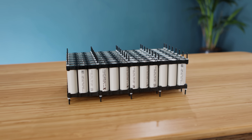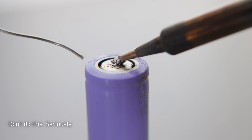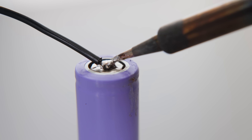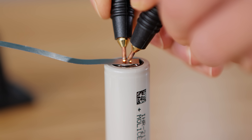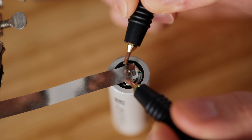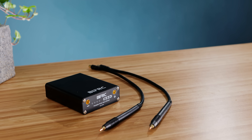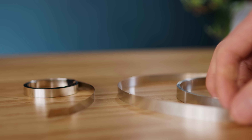Before that though, the next job is to wire up the cells. Now if you've seen other videos on YouTube you might have gotten the impression that it's fine to just solder wires directly onto them, but this is actually a very bad idea — it can not only result in dry solder joints due to the mass of metal that has to be contended with, but it inevitably also results in the battery being heated up to sometimes quite an extreme degree, causing internal damage and harming its lifespan and stability. A much better method is to instead use what's known as spot welding, which basically involves conducting a low voltage, high current between two pegs to weld a nickel strip directly onto the cell's contacts. If done right it results in the nickel strip being very well secured to the cell, and as the welding is so brief it doesn't have a chance to cause heat damage. For smaller builds, cheap battery-operated units can do an adequate job of this, but only with thinner nickel strips. As I want to use some pretty thick strips for high levels of current draw capability, I'm going to be using a much bigger welding unit instead.